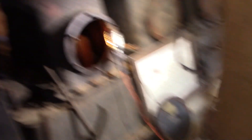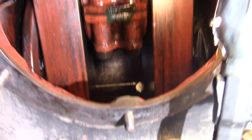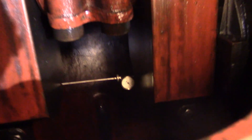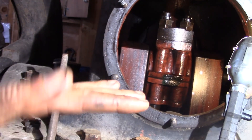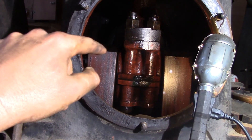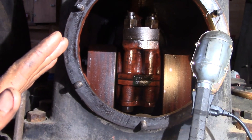The way you do that is with a crankshaft distortion gauge, which you see here mounted between the crankshaft webs of the cylinder closest to the flywheel. The purpose of this gauge is to see whether the weight of the alternator influences the crankshaft up or down, and as you rotate the engine from top to bottom dead center it will smush the crankshaft web in or splay it out.